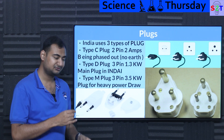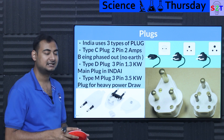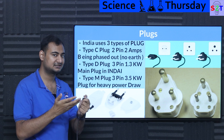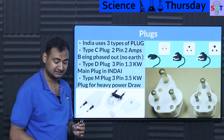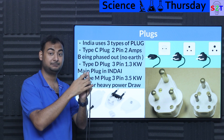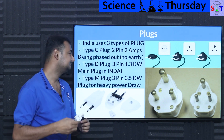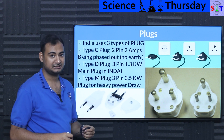What they're doing is clever: they're not removing the plug itself, they're removing the sockets for it. You'll notice that Indian mobile chargers that are packaged no longer have the Type C pin layout. Mobile chargers are switching to Type D pin, where the live and neutral pin gap matches a D shape rather than a C shape — so you cannot insert a Type C plug into a Type D socket and vice versa. Even though they may both look like two-pin plugs from the outside, they are not intercompatible.